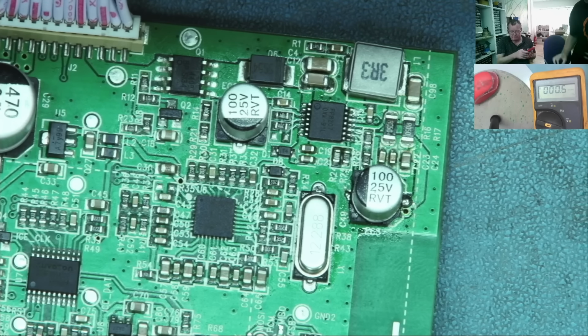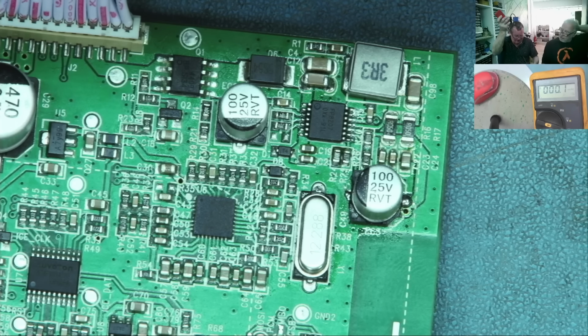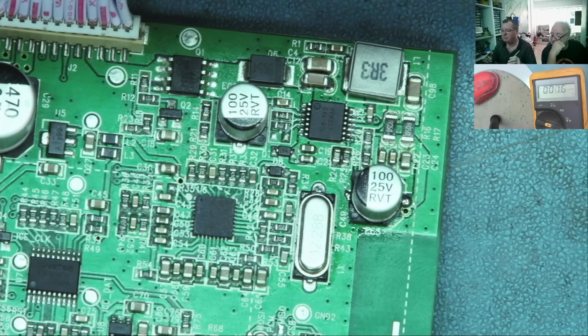This charge voltage, I mean, the resistors are 0.05 ohm, two in parallel, so that's 0.025 ohm. Oh, yeah, you're right. So this is going to be a very low voltage. It should push some current through there. Even if it was 1 amp, V equals I times R, which is 1 times 0.025. You're right. So it's low. It's 0.025 of a volt.